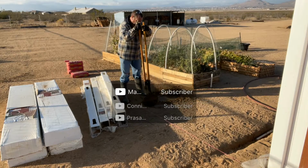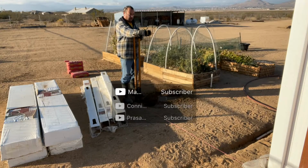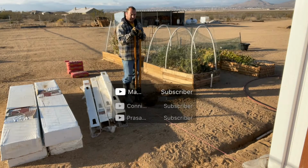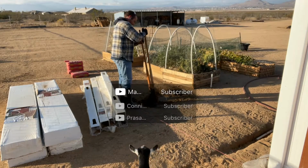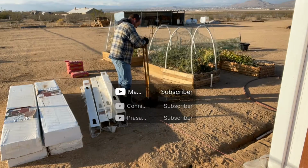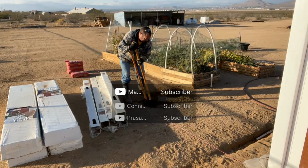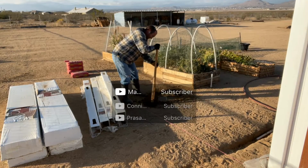Okay. And once you get it about the right depth, what I'll do is I'll go towards the fence and away from the fence just a little bit to provide a little extra wiggle room, because I found that sometimes you need to slide it back and forth to get a nice tight seal. So I found this as a technique that helps. I just use my post hole digger to kind of scrape away that side wall. Then I'll come back and use it to pick up the dirt. I'm sure there's a better way for that, like using an auger.